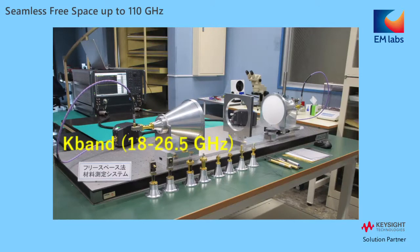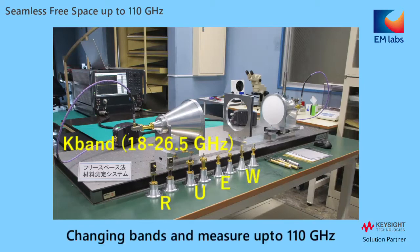Initially, the K-band adapters are connected for measurement from 18 GHz. 4 adapters are prepared in front: R-band, U-band, E-band, and W-band. I will change the adapters one by one and measure up to 110 GHz.